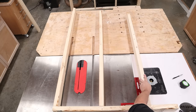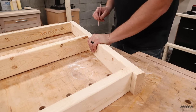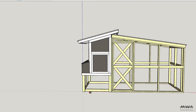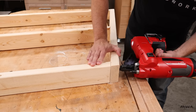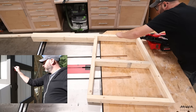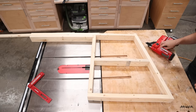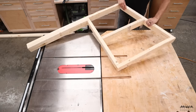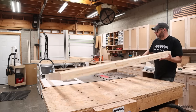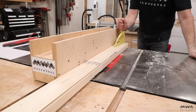Assembling the walls is pretty easy, but the design has a slanted roof so I need to cut that angle into the tops of all the studs. I asked the internet what's a good angle for a chicken coop roof and got everything from 5 to 18.5 degrees. After designing it out I went with 15 degrees — it looks good and is easy to remember. On the access-door side the studs don't go all the way to the ground, and I doubled up the front stud for strength. The front wall continues the angles across the top, and I also framed in a couple of small shed windows, including a header board with a 15-degree angle cut so it lines up flush with the angled studs.